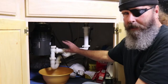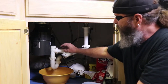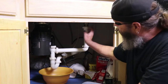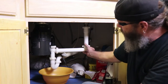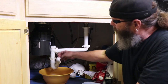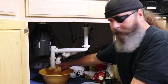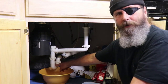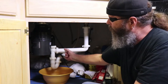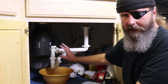This is going to be a fairly standard setup underneath any double kitchen sink. This is where your garbage disposal is, this is where it comes in, and this is where the drain is from the other side of the sink. If you're getting water up into both sides of the sink, then chances are it's going to be down here — and this is called a P-trap — and this is usually where it's going to back up. Sometimes it will back up in here, but it's best to just take a look at all of it.